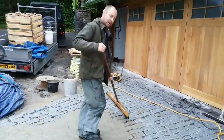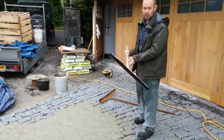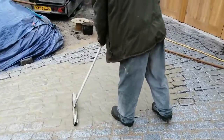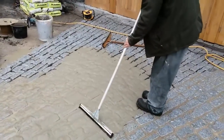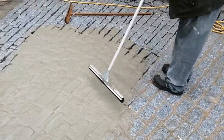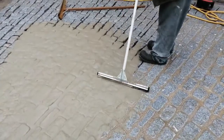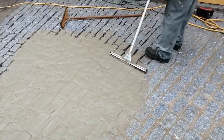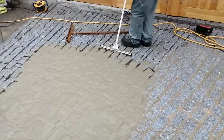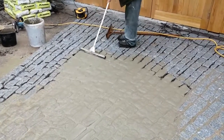At this point I normally move on to this, which is the foam squeegee. There's a neoprene one — this one is a bit softer. And this just allows me to remove a little bit more of the product. You can see I'm able to get a little bit more off. Of course I'm gliding over the top of the joints, so I'm not pulling it out of the joints. You just work it in, just like so, until you've got as much of it off as you can.